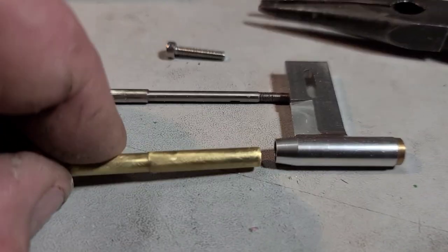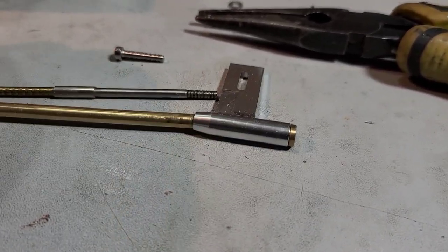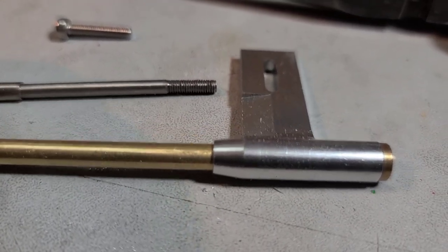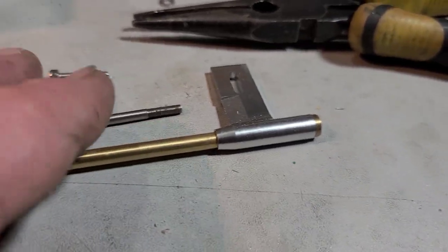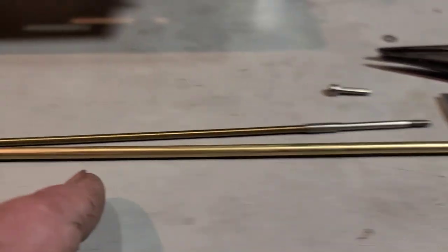All right, I had to shim up the strut with this smaller stuffing tube with no liner. It's a little bit of play, as you guys can see. When you got a little bit of play, a little gap in your stuffing tube to strut connection, water will be forced in the strut, and a lot of times it'll go into the stuffing tube and in the boat.